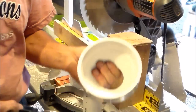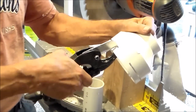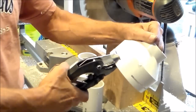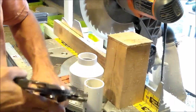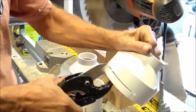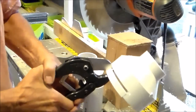These slots were cut one half inch from the bottom edge. Now I'm going to remove the excess material using my tubing cutter — this is what I did on my bell siphons. This material is schedule 40 and it's really heavy; there's not a need to have such a heavy pipe. You can see it's a little bit more difficult to run the shears through this pipe.